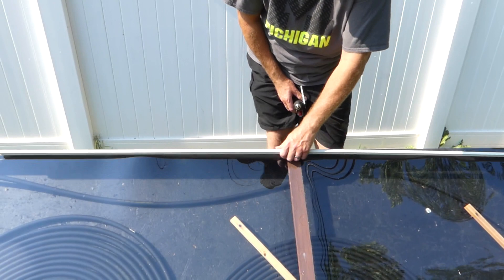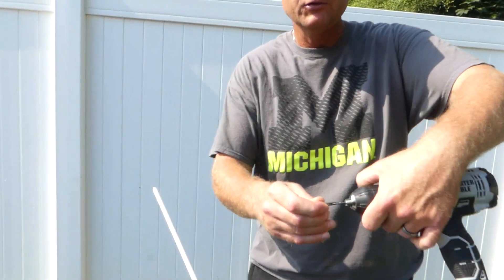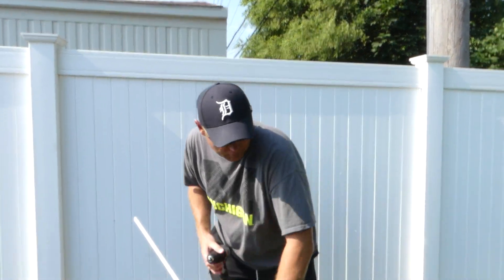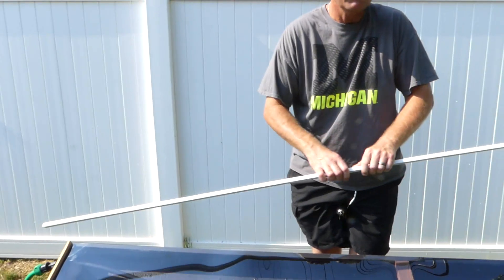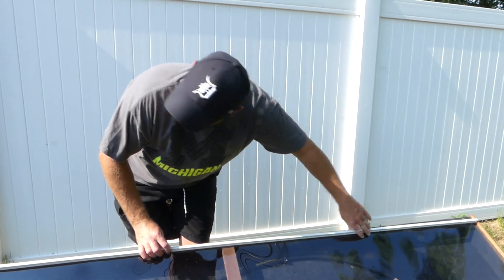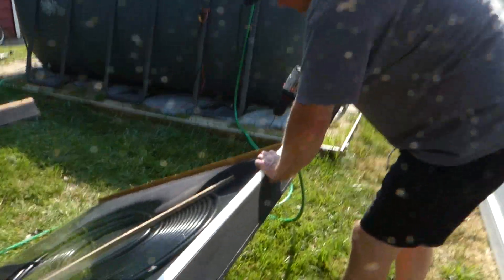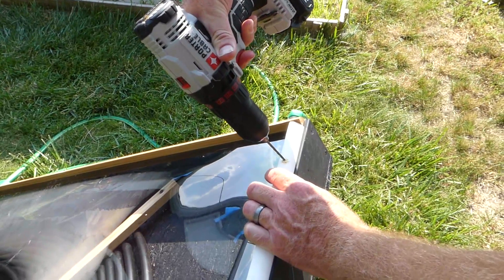So basically what you're going to need - find a drill bit that's about the same size or slightly smaller than the screws you're going to use. That way we don't split the wood we're using. We'll drill a pilot hole first and then we'll shoot the screws in. So if you do your ends first, you're probably going to have to shave about an inch and a half off the 8-footers to get this to fit inside here. Get that down and we'll start at one end - get it as square as possible. Then we're just going to drill a nice little pilot hole right through the trim, right down into our 1x4 that we built it with.